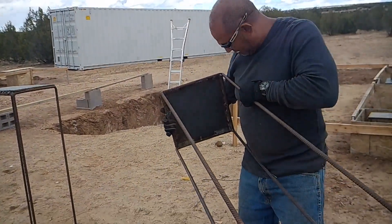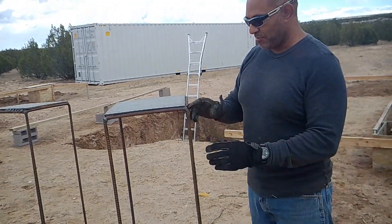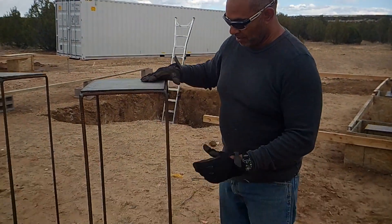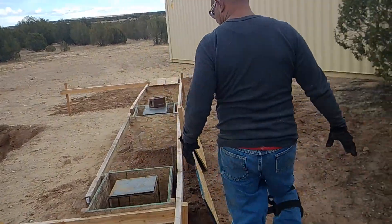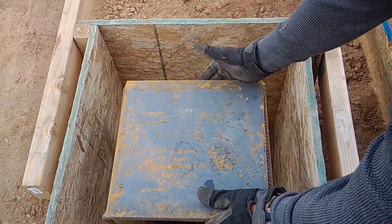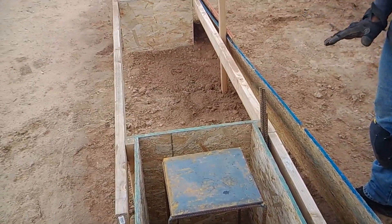You can see where she welded it to connect this to this. We basically took some rebar, bent the rebar, created a square, and put a piece of quarter-inch steel on top of the rebar and welded it. These forms here are four feet tall. They sit inside the wood form that we dug into the ground. When we pour the cement, the cement will sit in here covering the rebar, and this metal sheeting will sit right at the top of the cement base.